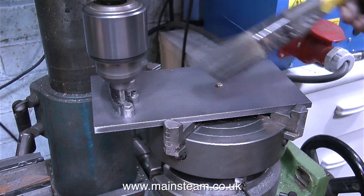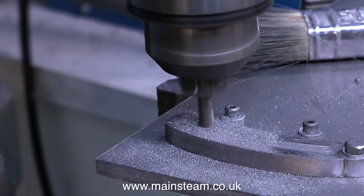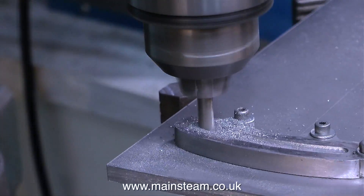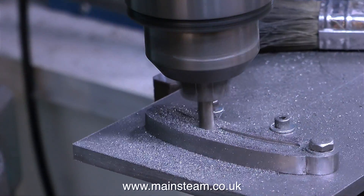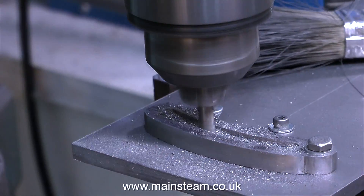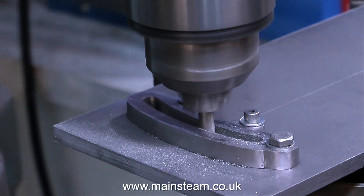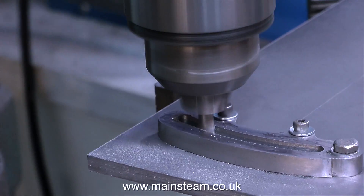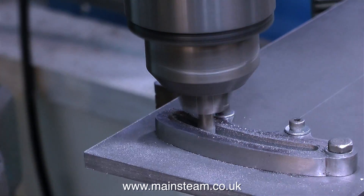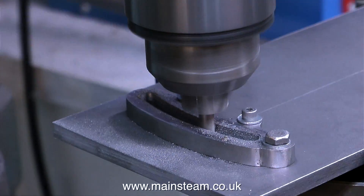And now it's fun time. The first cut taken is very shallow, just to confirm that the cutter is in the right position. This next sequence took over an hour to complete; the video has been speeded up to show the process in full in a reasonable time. The more I watch this clip while editing, the more I think it would make a good relaxation video running slower with some gentle ambient music. On the other hand, I'm not relaxed at all — because if anything goes wrong with this, I have to start again. The absolute worst case scenario is that the milling cutter breaks and damages the slot, or the whole thing disintegrates. That's why I used the Loctite 603 to hold the blank firmly down to the plate — but the combination of Loctite 603 and the three bolts means it's highly unlikely to come loose.